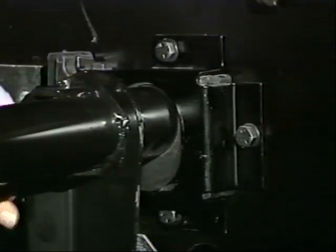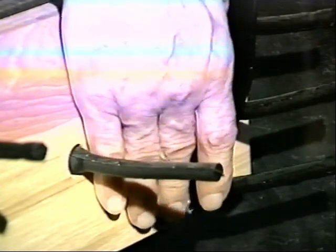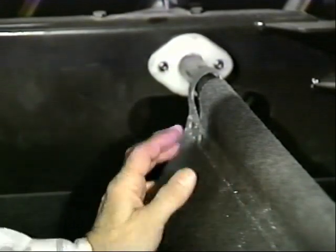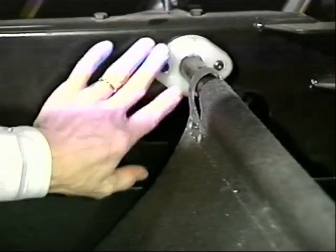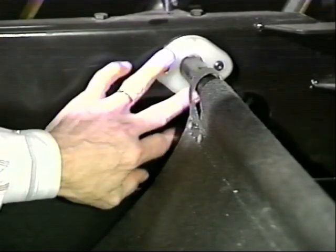We would also need to follow the leg down and inspect the hardware where the plank is attached to the hanger leg. We would inspect the entire pin curtain, making sure the stitching is good, rivets are tight, and the curtain rod itself is not bent. We'd also check the condition of the phenolic insert where the curtain rod goes out through the frame of the machine.